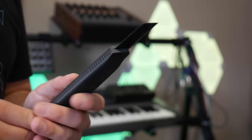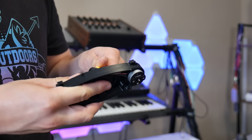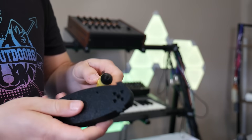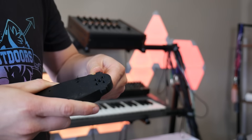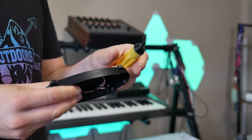When I'm marking 3D prints during reviews, I use paint markers because they make it easy to identify parts. The mark they leave is really durable. If you're building or repairing anything and need to mark a fastener or a part's orientation, and permanent markers aren't permanent enough, try paint markers — incredibly durable, and they don't dry out nearly as much as you'd expect. Next up, the humble deburring tool. I only bought one two years ago and I don't know why I waited. I was using a Stanley knife to remove brims and clean up print edges, but deburring tools make life so much easier and are far safer.